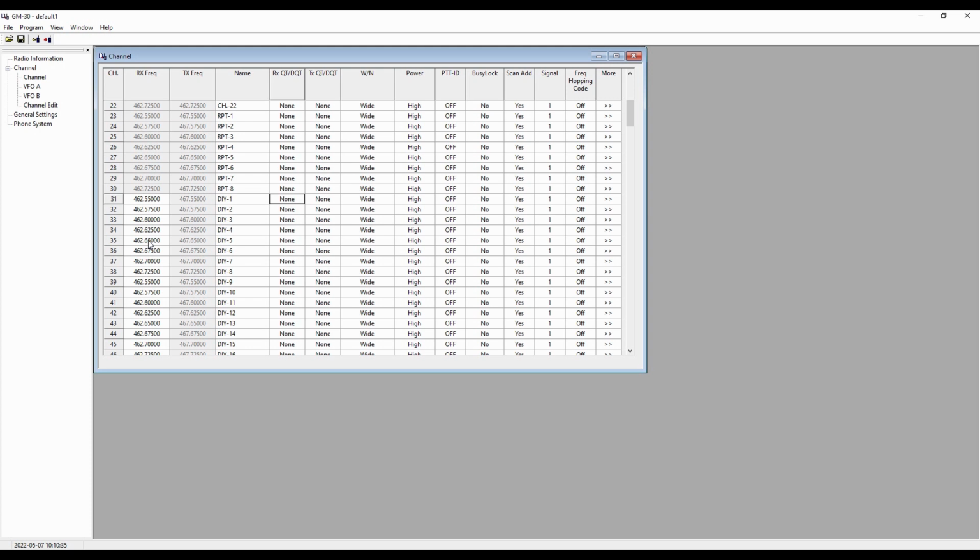So those are the 2 primary things you're going to notice with CPS software. Some are going to give you the standard repeater channels and then up to 24 additional do-it-yourself channels, but they're locked, or others are going to give you the ability to make changes as we just saw. So for example, the BaoFeng UV9G has these same channels, but they're locked. You can't do a drop down and make the change. You have to change via the assigned channel. And so it's just another way that particular manufacturer chose to implement DIY channels to maintain compliance with the regulations.